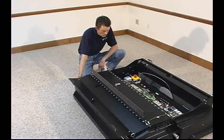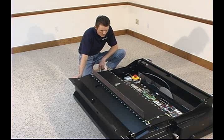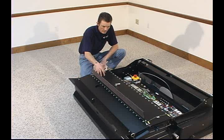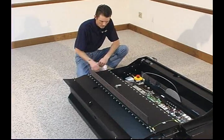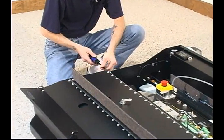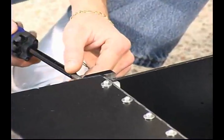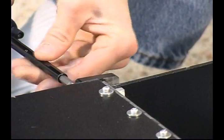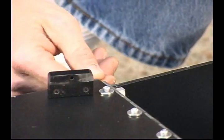It is very important to make sure that the oil head and the cleaner head are timed correctly. Before we do this adjustment, it will be necessary, to make the job easier, to remove the lid for the lane machine. We're going to do that by actually taking off this support block that connects to the side plate that holds the lid in place on the 10-pin side. And we'll remove both of those screws from the block and pull the block off of the hinge pin.